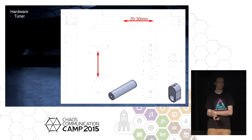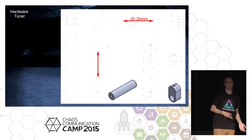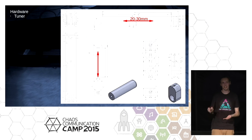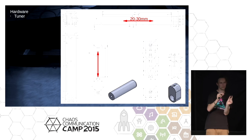And I think that's version 7 of my design. I made the first design, and it wasn't possible to manufacture this at all. You would need special tools that are much more expensive, and so I went through a lot of iterations and finally came up with this design that's easy to manufacture and works really well. It basically just holds the string, and then you can pull a knob, and that knob pulls in a little threaded rod that's fixed at the point where the string is grabbed, and so the string gets moved along and tension is applied to the string.